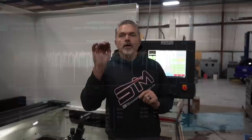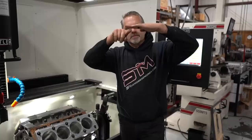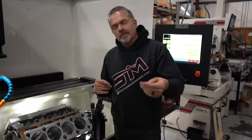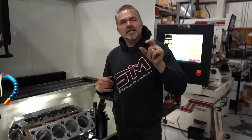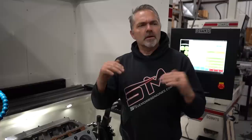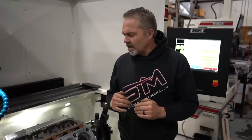We honed a block in the old machine, the standard method that I used for the last 20 years. And occasionally, with the old method, I would have a piston skirt problem. Never really had ring issues. Because it's too fine, it's too smooth a surface is what I've been doing. So we want to have this VK where it's perfectly flat, but it has over-exaggerated oil grooves on the bottom. And that oil is lubricating the ring without hurting the ring. And more importantly to me, it is lubricating the piston skirt at the same time. So it's going to help with any kind of scuffing issues, because over the last 20 years, occasionally I'd have one engine in particular that would scuff a little bit more than another one, and then the next one comes back and it's absolutely perfect. The skirts look just perfect. And I think it's because I've been a little inconsistent in my surface finish, and I'm too smooth in my surface finish.